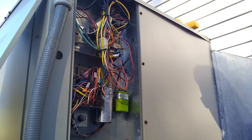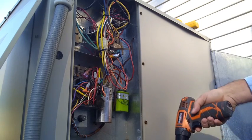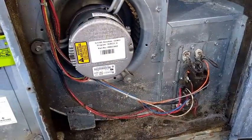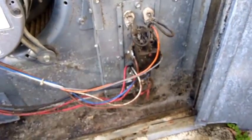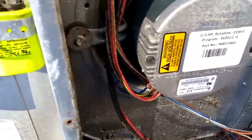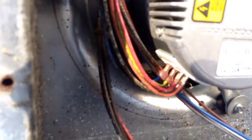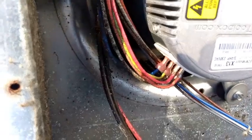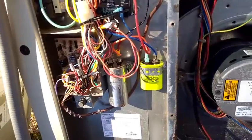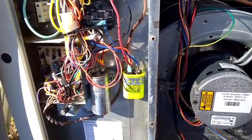We had issues with the contactor before, so I got them to get a service switch — I thought it would be a good idea. The blower is in this compartment, so we're going to need to check the blower capacitor by removing this door as well. This is an X13 motor — you can see it written on top there. The heat kit has a contactor; we'll take the lid off and take a look at the contacts, see how they look. It's kind of dirty in here, so I might sweep that out. I typically do my cleaning in the spring, but it's gotten a little dirty since then, so I'm going to clean this out a little bit. We'll test the run capacitors and then we can get this party started.